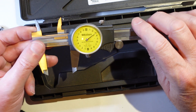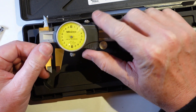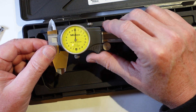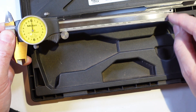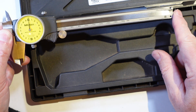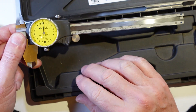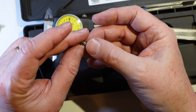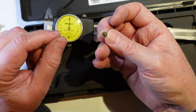I had to redo that because the pinion wasn't quite set in the hole, but I've got that all set up now. As you can see I've got smooth motion - it zeros, I can come out and come back and it re-zeros, so it's not skipping any teeth or giving any clicks. Successful repair! The only other thing I need to do is make a little bar shoe that goes across so the jaw can't slide right off the end - just a piece of flat material with a couple of screw holes. But there you go - that's what's inside a dial caliper, and if you've dropped it and it feels notchy, it could well be something like this little pinion, smaller than my fingernail, causing all the problems.